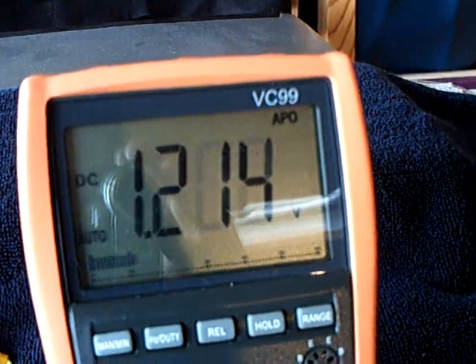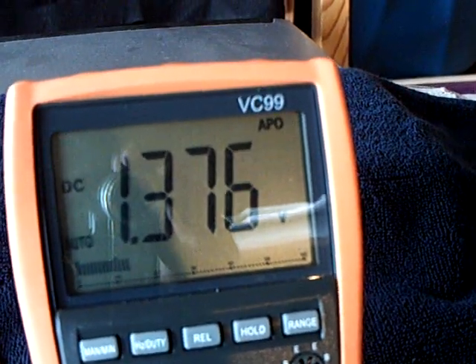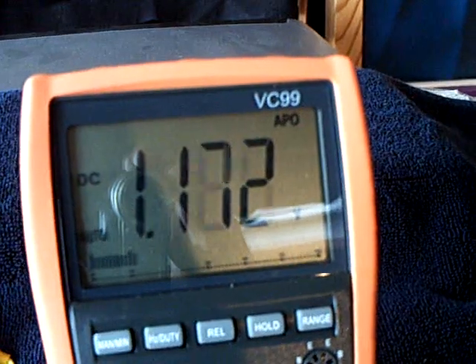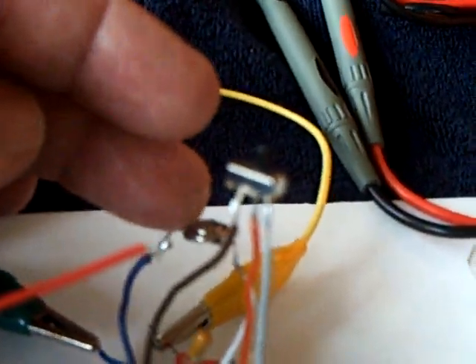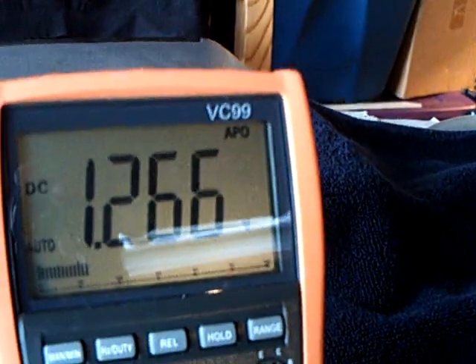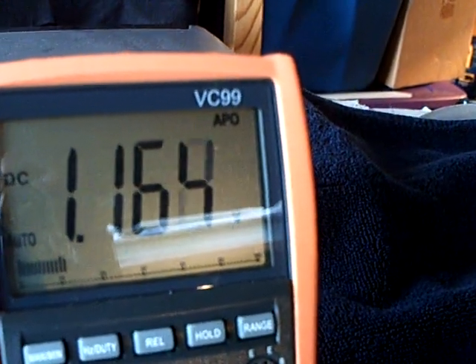Loop off. And it stops — it doesn't keep climbing. See how that starts dropping off again? So mine doesn't do what his is doing, but I am getting this effect. Here's the loop off again — dropping like a rock. Here's the loop on. I don't know if this is a meter reading thing that I'm seeing or what is going on here. But when I flip this little switch back and forth with this drive battery disconnected, and all I have is this little tiny polystyrene capacitor and that little tantalum capacitor — which is about a 10 microfarad — I'm getting this effect. Here it is with the loop on. There's loop off. Look at how fast that drops off. Loop on — see how that climbs back up again? Loop off.